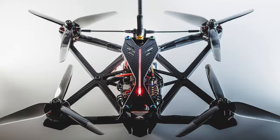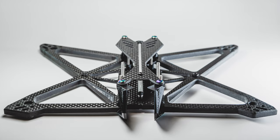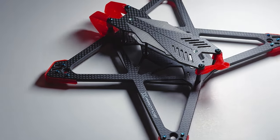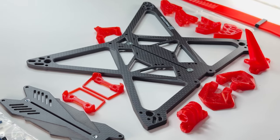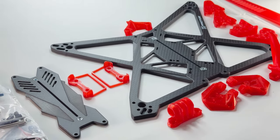Total 5 was an entire year in the making. It started out very minimalist, and from there I just made it more and more functional. The base is carved out from a one-piece 5mm T700 carbon fiber. Being one piece takes more time to machine and creates more wastage — this is why it's not common for frames going over 3 inches to be this way. But being one piece makes the frame very stiff.